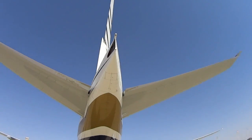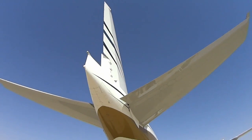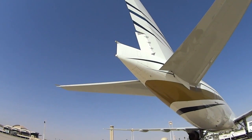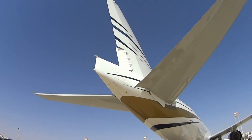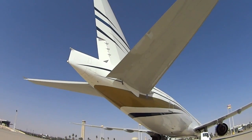All that jet fuel smells good. There are a few doors open — that's where the air goes in for the APU. The APU is in that little compartment behind the pressure bulkhead. That's what's generating our electrical power and pneumatic power right now.